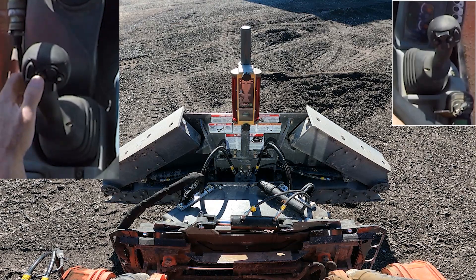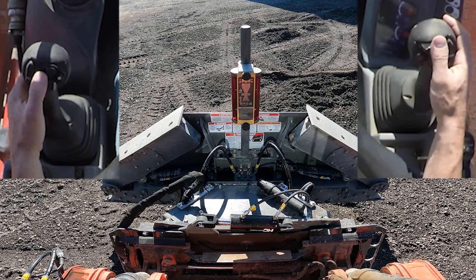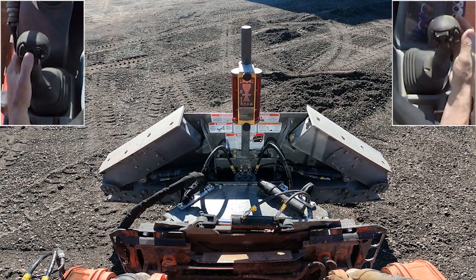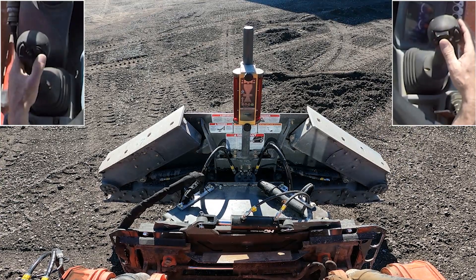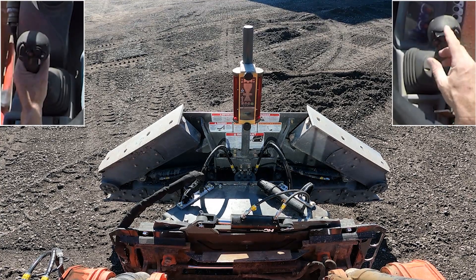I need to activate the electrical system by pressing and holding the button, and then I send oil with the hydraulic auxiliary to open or close the wing. Same goes for the right wing — I activate the right wing, hold it, and I can open or close it with oil. We have customers calling saying they press the buttons and nothing happens — they just need to send oil as well.